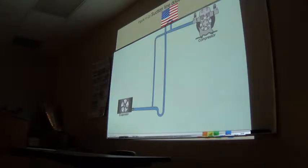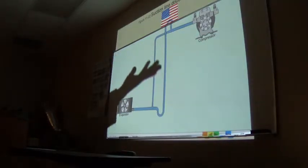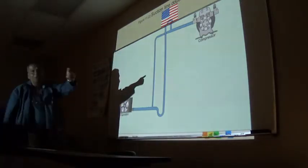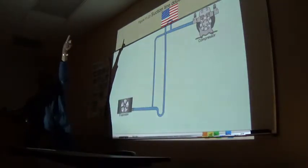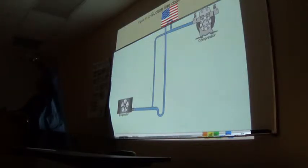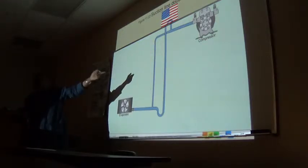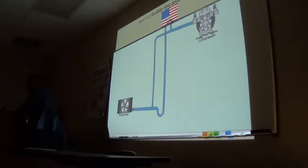Now if I'm going up to the roof, which is 30 feet up, you have to figure I need a P-trap down in the box, and I need at least 2 more in between when I get up. Then I need a reverse P-trap up on the roof. So I'm looking at 4 traps. Add that in. Then I need to trap the discharge line.